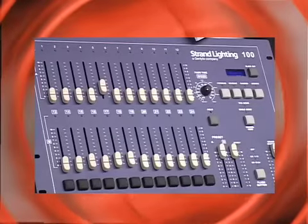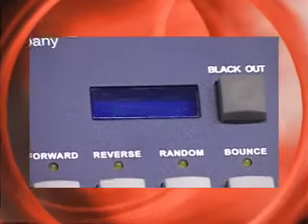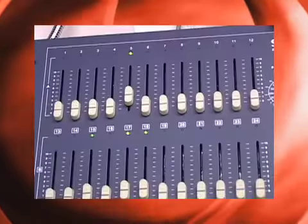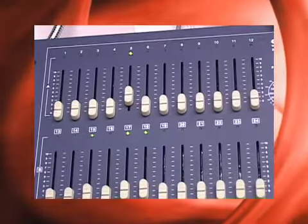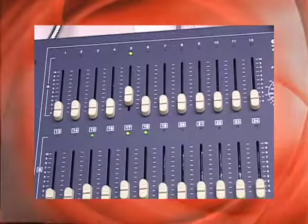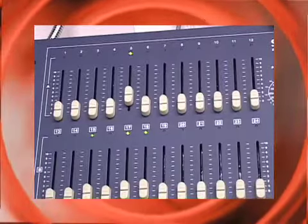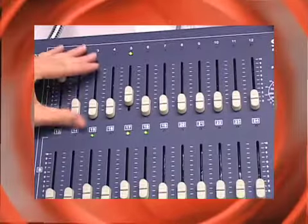First, make sure the dimmer panel is not in blackout. If it is, push this button to turn the lights on. Select either the A or B panel. The lights then work on a slide pot. Adjust the light to the brightness you want it to be. The idea behind the dimmer panel is that you have more control over the brightness of the light. If it is hitting too hot on the face, you can adjust it down.